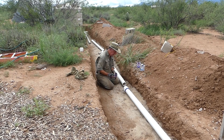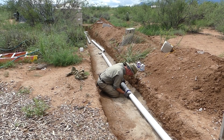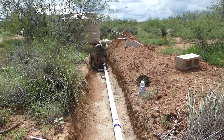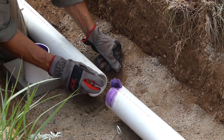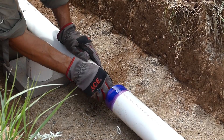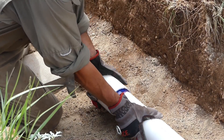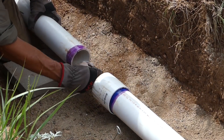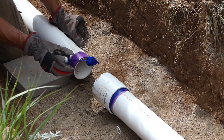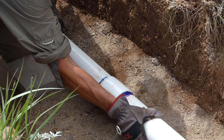The very first piece of PVC I glued, I put on way too much purple primer, but after putting a few together I got into the rhythm of it and did a much neater job. I was pretty stoked that without any previous experience I was now gluing pipe together. Not being professional, I was much slower and more methodical. Confession time: once I grabbed the glue first and put it on before the purple primer. So I developed a mantra — 'Purple is royal. Royalty always comes first. And then blue.' I let the glue dry, put purple primer on top, then more glue, pushed the joint together, and it seems as solid as all the other joints. During the test it showed no sign of leaking.